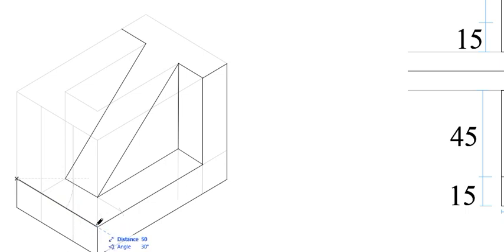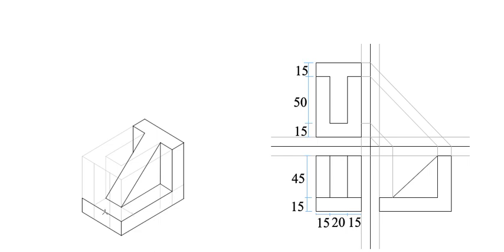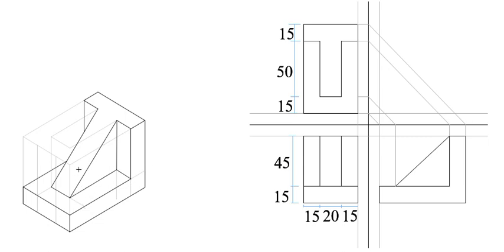This one comes here like this. Let's finish the top - that one goes there like that. Then you shall assume that this part is going down straight, so you take it down until it intersects this point. The other point is this other edge - with your T-square and 30 degree set square, just draw this line until it gets to this point. And that way you shall have your diagram in isometric view.